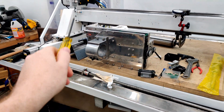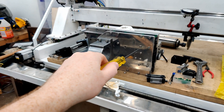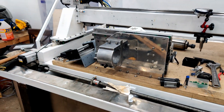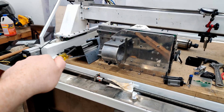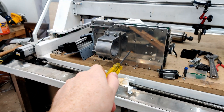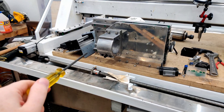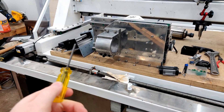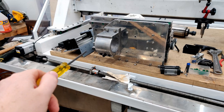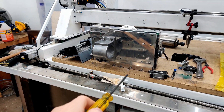When I get to the probing stage, I will map out the motion of the ball screw on here relative to the motion of the ball screw when I put the new one in. I'm not just going to go by the pitch of the two ball screws and calculate it that way — I'll actually map it out. I'll set up an electrical mechanism where I move the Z assembly down slowly until it makes an electrical connection, do all this through Python, and make a very accurate map. That way I'll be able to find very accurately the Z position and check the repeatability of the whole system.